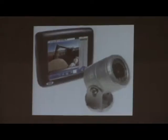I also run a camera, and I like the camera because sometimes when you're looking down at your row, you get one view, you think you're on the row. You get out and walk and look behind, you realize you weren't really quite as on the row as you thought. And you get another perspective. You can put that camera right down on the row and watch that row go through the cultivator. So it gives you a little more perspective.